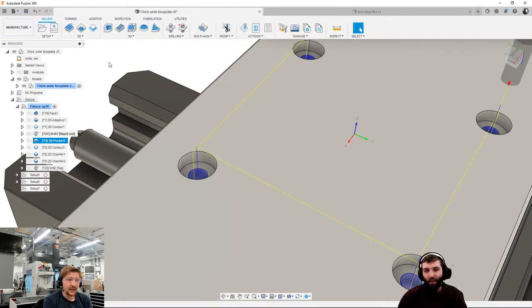Yeah. And I think you drill it first so that you don't have to ramp. It's like a pre-drill point, right? So you can put your tool straight in. You've been paying attention, Spence, not just on these live streams. So yeah, everyone knows that I hate ramping. I always make a point that I try not to ramp. Doesn't do the tools much good and takes forever.